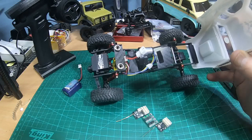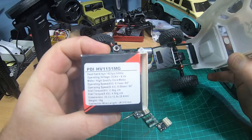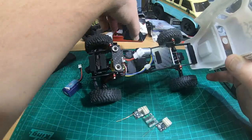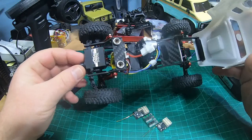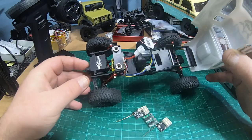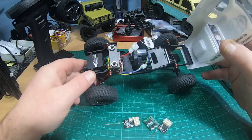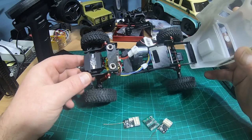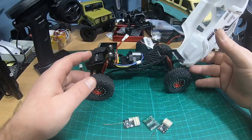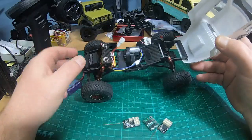In this truck I use the JX PDI HV 1151 MG, which was originally made as a shifting servo for the TRX-4. Many people want high voltage servos, but then why do you need a BEC? Most new receiver units can work with 8.4 volts, so no BEC is needed — directly powered. You can see all the tiny electronics sitting here with a lot of room.